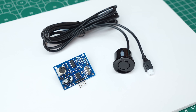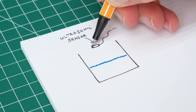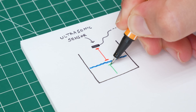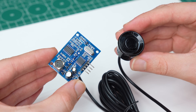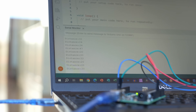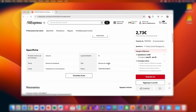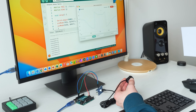To do this I chose to use an ultrasonic sensor, which is able to measure the distance from an object. My idea is that by placing it on top of the container we can measure the distance between the sensor and the surface of the water, and therefore know how much water is left. At first I had chosen a sensor with only one transducer connected to its board. I 3D printed a holder for this sensor and connected it to an Arduino to see the measured values on the serial monitor. Once mounted this sensor appeared to work just fine — until I picked up the tape measure and realized that the measurement was completely wrong. After some research I realized that this sensor detects a minimum distance of 25cm, which was too large for my container.